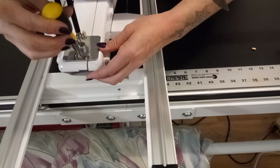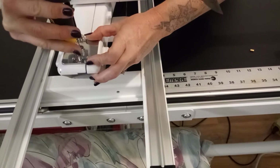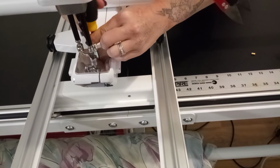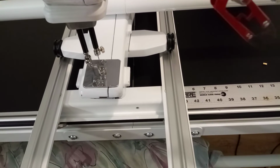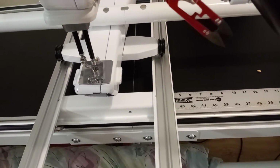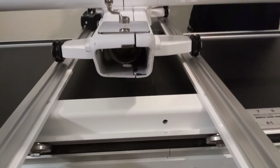Alright. There we go. Now tighten it. Just like that. So you can now see that my wheel and needle land exactly in the center of that hole, where it's supposed to. Also, I'm running the oil through it right now by doing this. So the oil is now running through that bottom section everywhere that I put it, because every 6 months or so I do that.